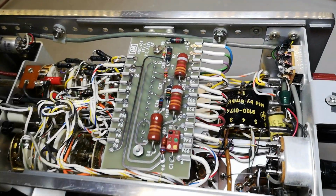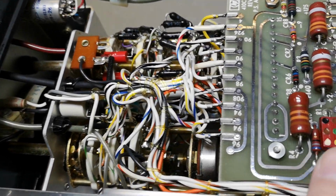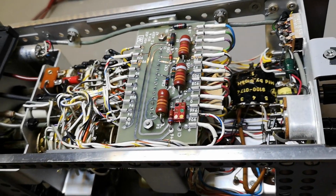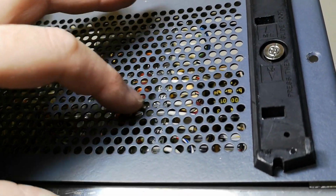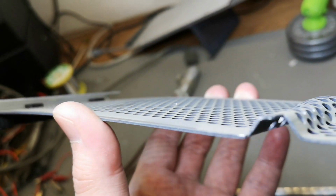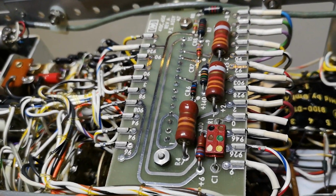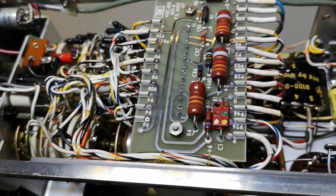There is actually a long time between when I find something really bad in HP products. But look at those resistors. They got some nasty marks on them. And this is because of this back plate, or the bottom plate here, is just so close to the resistors, and it's very thin and flexible. You can even see that it's bent in. So that means it's really easy to damage the resistors here because they're just too close.